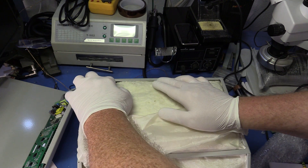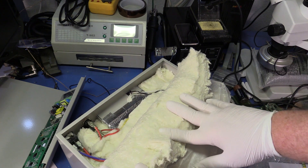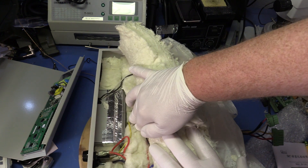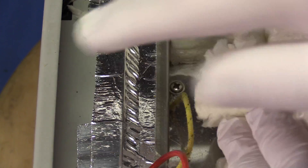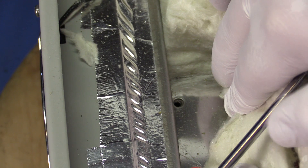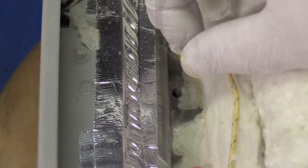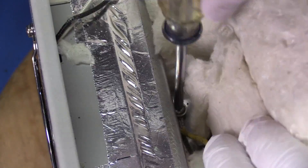I'm putting on gloves because it's pretty dusty inside and I don't want to get fiberglass all over my hands. Let's take a peek at the input wiring. There's lots of insulation inside. All the connections here are made with insulated quick-disconnect terminals. Here's the ground lead — it's bolted to the inner part of the chassis. It still doesn't have a lock washer or any teeth, but at least it's actually screwed to what looks like a weld nut or riv nut, so it is electrically connected to the case. I'm going to add a couple of tooth lock washers to this ground connection to make sure it can't shake loose.